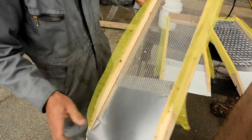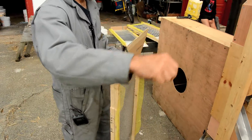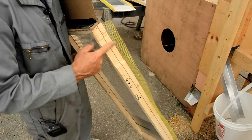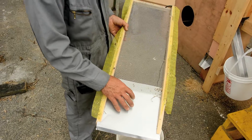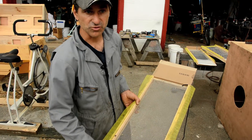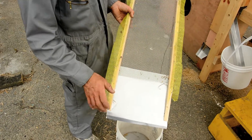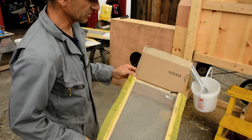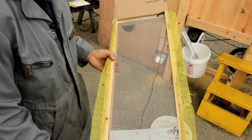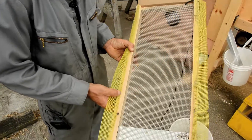The screen can hang on a quarter-inch metal rod that goes through the frame. At the back, the screen has a string to hold it level, and a little notch, and that notch allows the shaker to move. When the seeds or debris get to the bottom of the screen, you just want them to accelerate a little bit and get moving before they leap off the end of the screen, so there's a piece of aluminum flashing at the lower end. There's also a little bit of gasketing cardboard, and the netting is drywall tape mesh, stapled on with a stapler so seeds don't get around the edges.